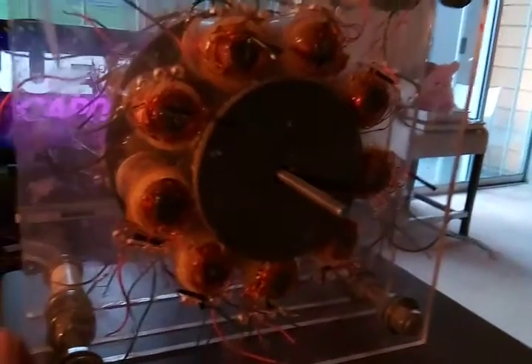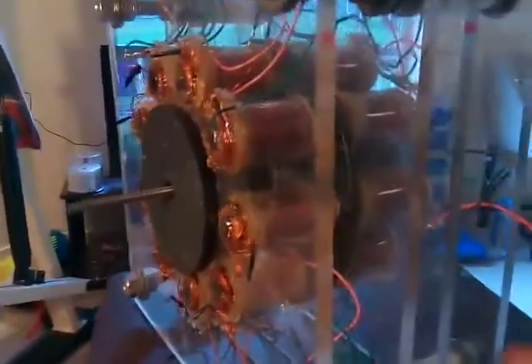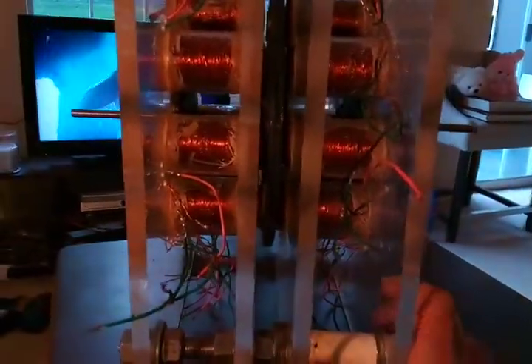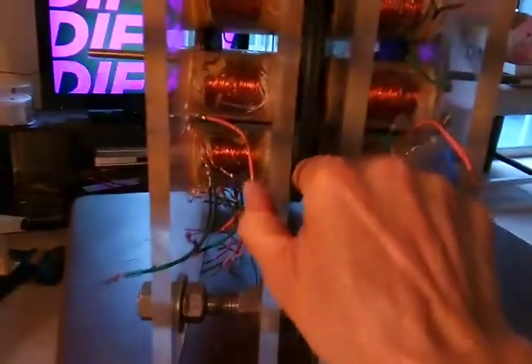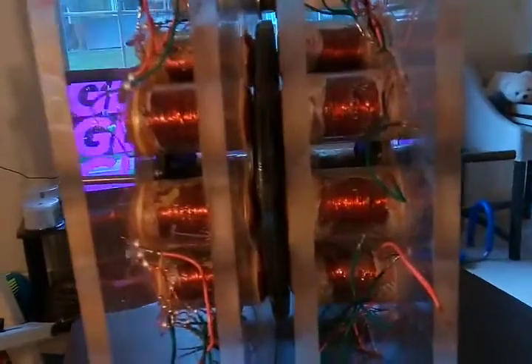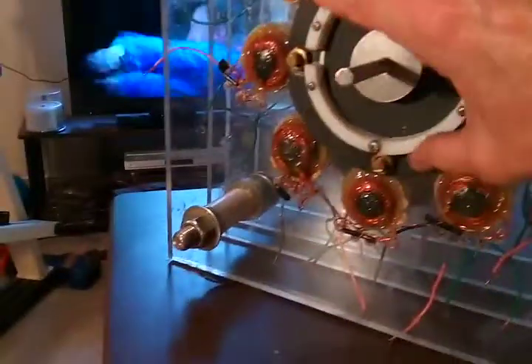So I was spinning it at 3600 rpm — makes a lot of power for each coil, though I don't remember exactly what it was. It has nine coil positions and a total of 18 coils. It has a rotor of ten one-inch disc magnets, a half-inch thick, neodymium grade 52.